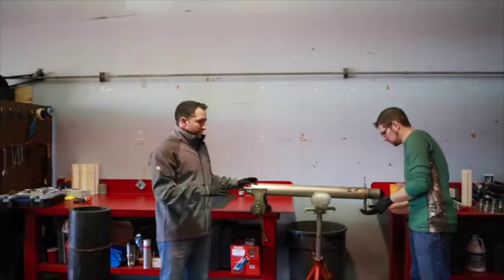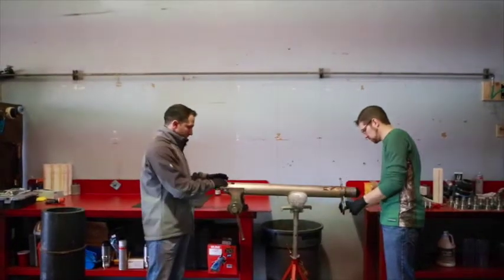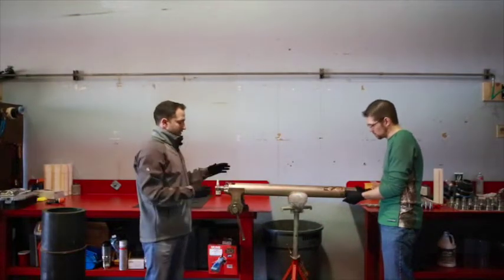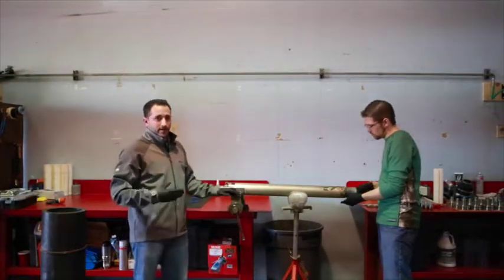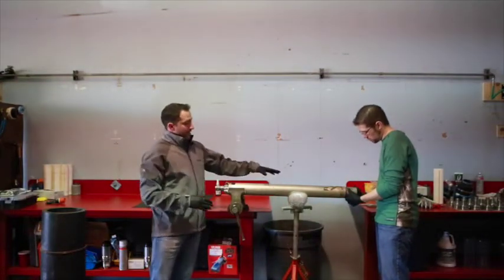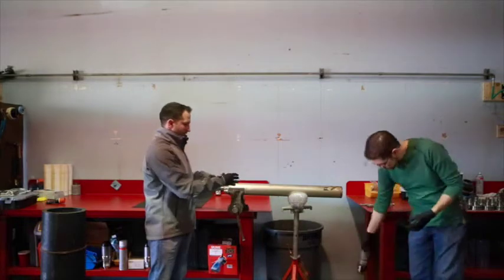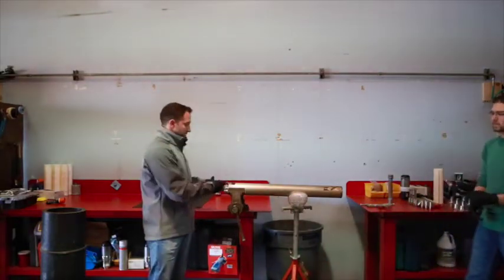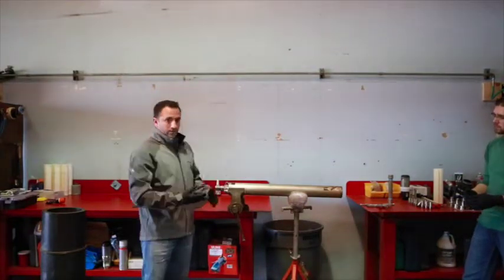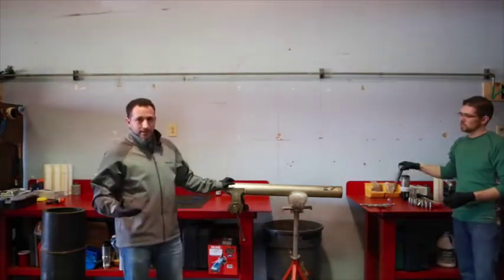This will just spin right out. One key important thing on this pump: as you can see, he's got the pump chucked in the head of the vise. It doesn't matter if you have a vise on the back of your truck, a shop vise, whatever kind of vise — you just want to make sure that the point you have secured is the head and not the casing. If the casing were chucked in the vise and there was severe scaling, the whole pump would turn and he wouldn't be able to successfully remove that bottom check valve. So that'll save you some time.